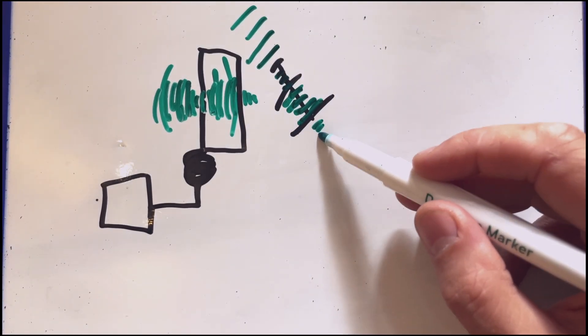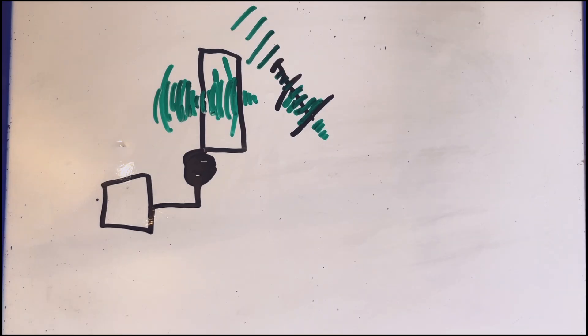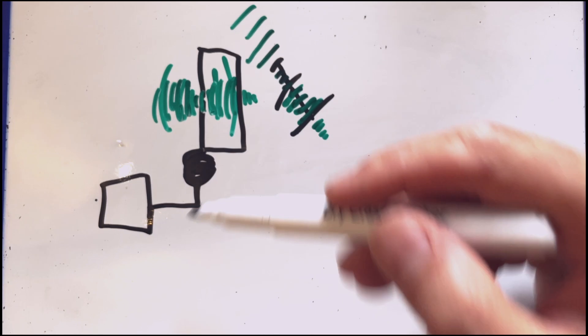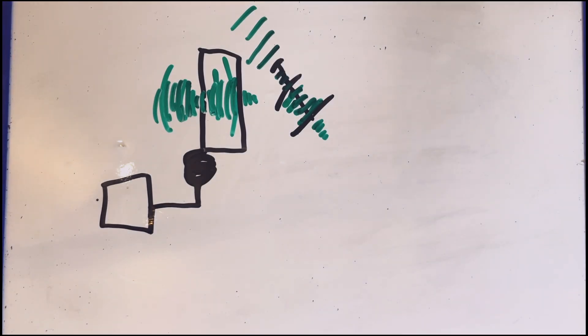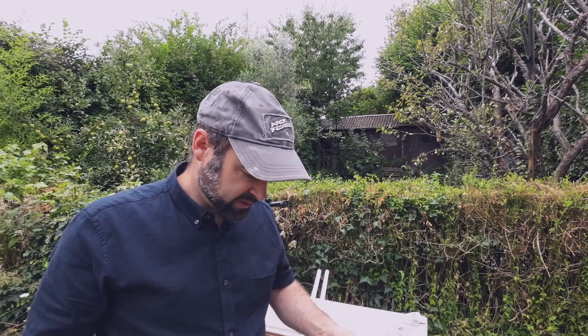There's less of a lobe of RF on the back end. So that's the basic idea and all this is tubing made from PVC. We're going to build this using PVC piping like in the traditional flowerpot antenna design.